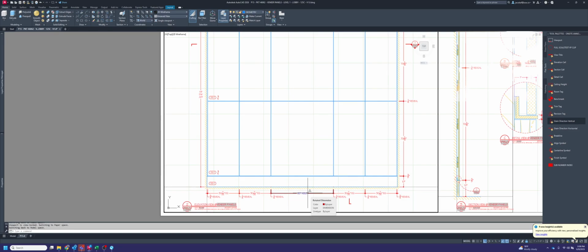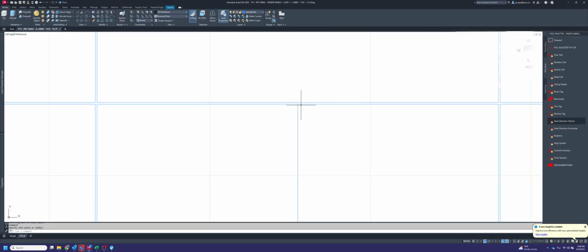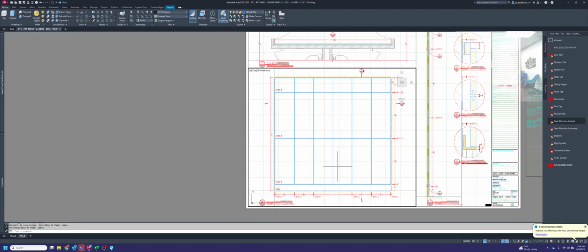Anything larger than that starts to become sort of a manufacturing issue. So let's say you have a panel like this that does need to be 60 inches wide, which is larger than the 48 and 96 on the other side. If it's an absolute need to be able to make a panel that way, we can do what's called a shop joint. A shop joint on a print is labeled with an SJ, which just stands for shop joint. And all that it is, is an invisible seam. By the time it's done being installed, you will not really be able to tell there's a seam there. But the seam is really important because it is what makes this panel be able to be 60 inches wide, because we can't make this panel 60 inches wide on its own. It has to have a seam in it somewhere for that to work.